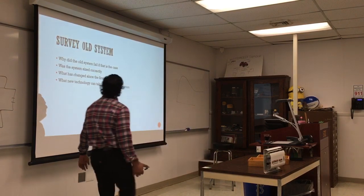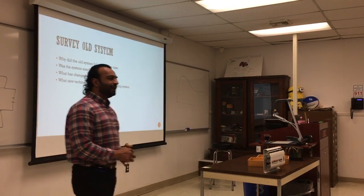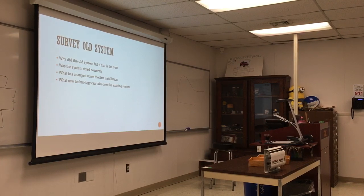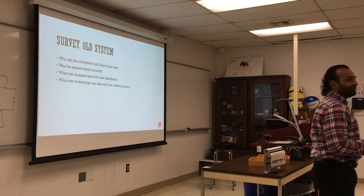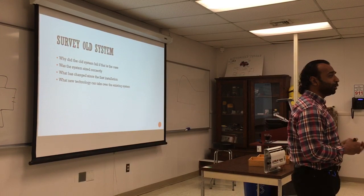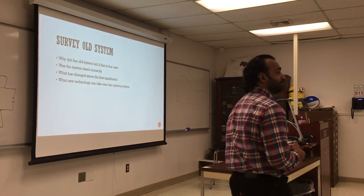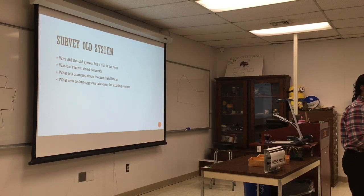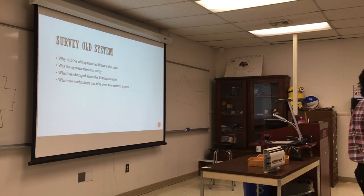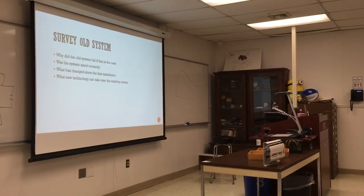When we size a system for a house, even if it's not yours, don't design for 65°F just because you like it cold — design for 70–75°F, something reasonable for the average person. Think of the future: if you sell the house and the system is undersized, the next buyer will notice. Many buyers only look at appearance — walls, carpet — but you should investigate piping and the heating system. One of your jobs may be to evaluate used houses. Restoring a new boiler with piping can cost around $15,000 — that's significant.